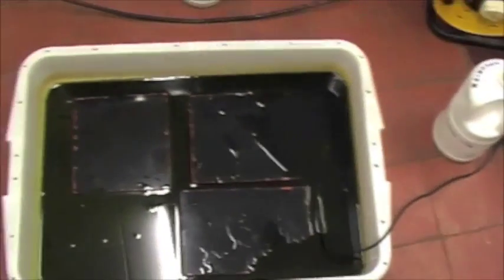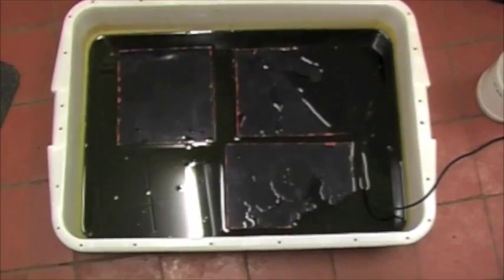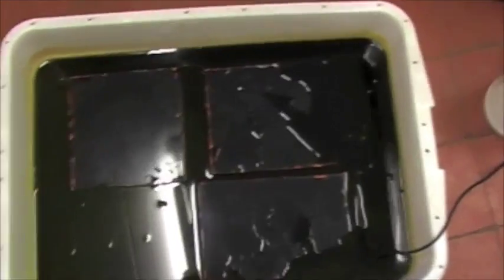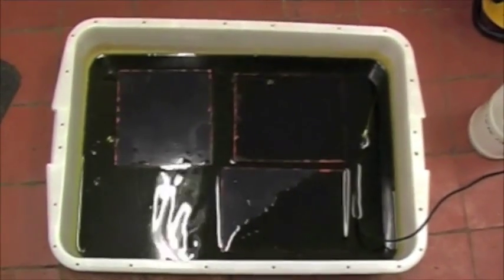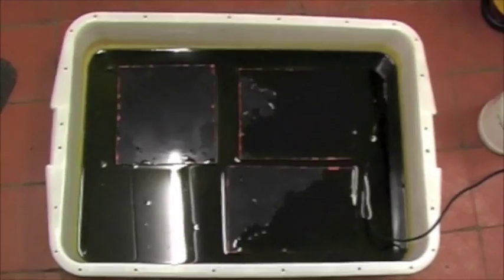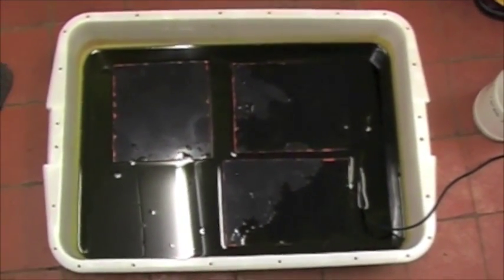The heater is actually buried in the fluid just at the corner there. You can etch without a heater but it'll take longer. With fresh ferric chloride and a heater functioning you'll get very deep etching in four hours. Every 15 minutes or so I just tilt the dish gently back and forward to make sure that fresh solution is presented to the underface. Do make sure all of the plates are in contact with the solution and watch for air bubbles underneath, otherwise you'll get areas that haven't been etched.